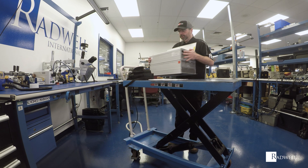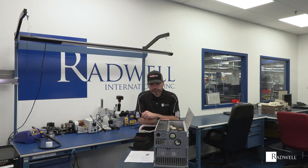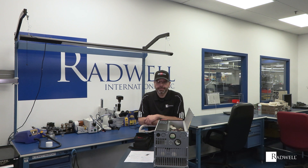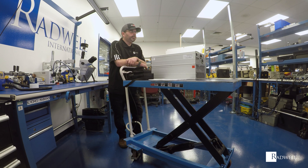The first thing we want to talk about is safety. These drives are generally powered by 240 or 480 volts AC, which can be very dangerous. Whenever your hands are near the power terminals, you obviously want to have the power off, and check yourself to make sure the power is definitely off — don't ever take someone's word for it. I've seen people get hurt in the field. Make sure breakers are turned off and disconnects are open.